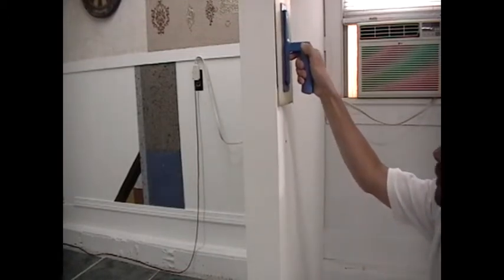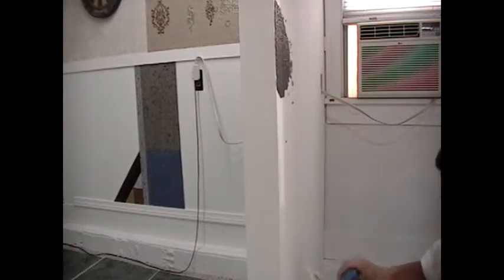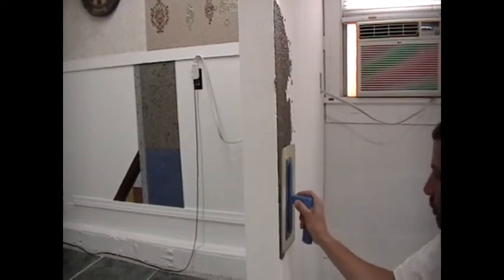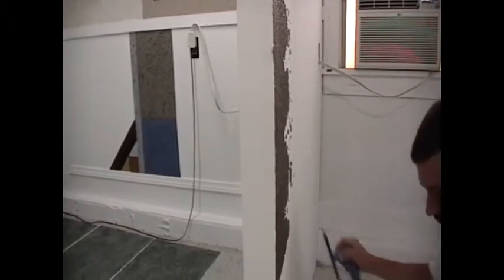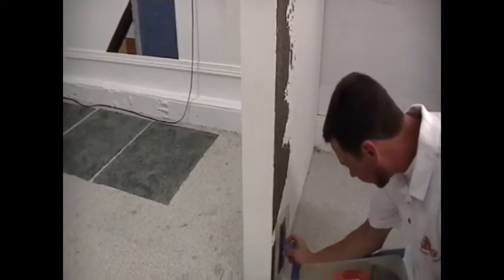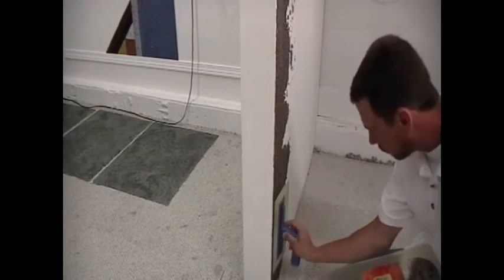Starting at the edge with a clean trowel edge, Eric will place 4 to 5 trowelfuls of material at the corner. Remember, when doing any edge, do 3 to 4 linear feet at a time, pulling the material 6 to 12 inches into the field area at appropriate thickness. This will make a quicker application along any edge.